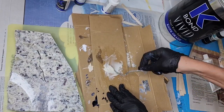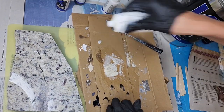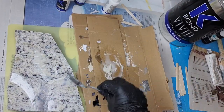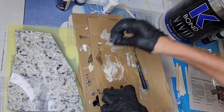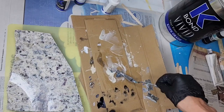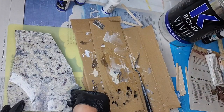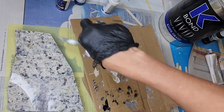Now that all my pieces are connected, it's time for the artistry aspect of this project. I'm mixing pigments — in this case it's not just a tan, it's mixed with a little gray, and I split it and mixed in a little white. I take small sections not yet mixed with hardener and mix each with a different pigment. I'm hitting just some areas, not everything, to preserve the chaotic pattern that this particular piece of granite has. The artistry involves going in layers, repeating the process until everything is the right color.